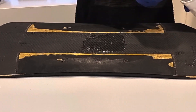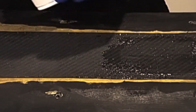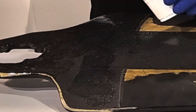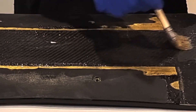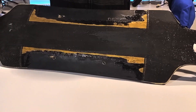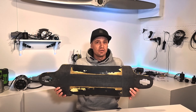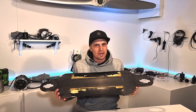Then I applied another coat of rubber toughened epoxy to try and fill the holes and blemishes, but even with pre-warming, this epoxy was so thick I just could not mix it properly without collecting a lot of bubbles. I did manage to sand out those bubbles but I still need to drill out the holes for the trucks, and the rubberized epoxy leaves a pretty cloudy finish.